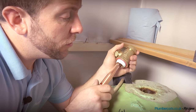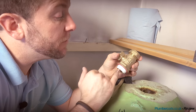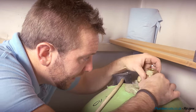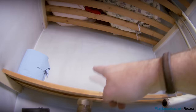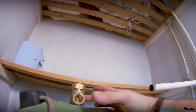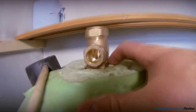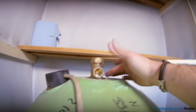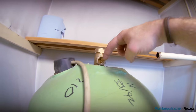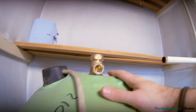I don't usually use PTFE on this, but because this fitting was so hard to get off and I'm worried about damaging the tank, I want to use something that's not going to clag up the thread too much. So I'll just pop this on here now and give it a little nip up. Now that we've got that in, what we're going to do is link up our vent pipe and expansion pipe. Let's do that by cutting an elbow just here, running that along and then elbowing down into this. Then I'm going to get a small stub of 22mm copper, run it out here, and turn the water back on - so I can test this joint for leaks before doing all the pipework for the new pump.